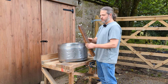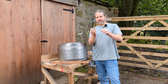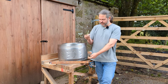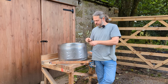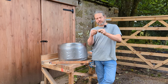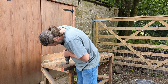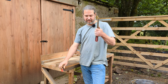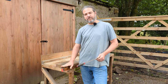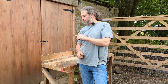All three legs are measured up and marked. The next thing is to clamp them in the vise and then use a step drill bit — once you have a hole drilled you can use this to enlarge it. The bolts we're using came from the same project the angle iron came from. We need to get the right size, which should be 12 or 14 mil — we'll go to 12, see how it fits, and if we need to make it slightly larger we can. There are some sharp edges left over from using the angle grinder, so I'm going to file those down so they're not dangerous. I also need to make sure the holes in the drum are the right size — they're a bit small, so I need to use the step drill to make them a few millimeters larger so the bolt fits in properly.